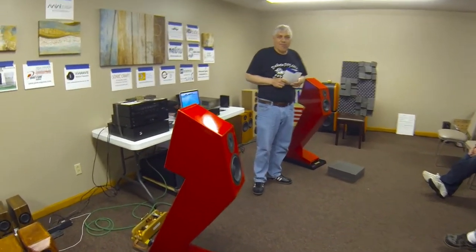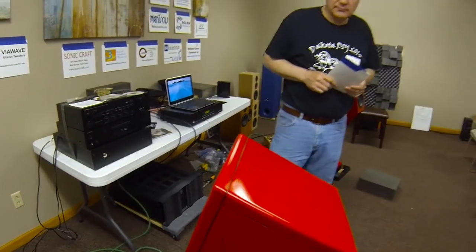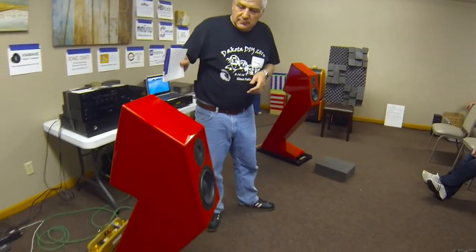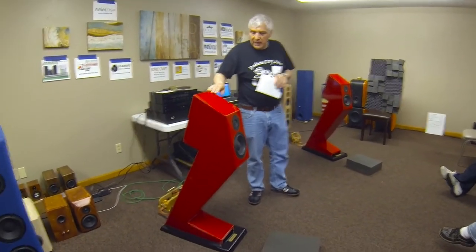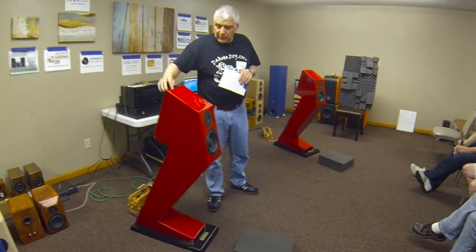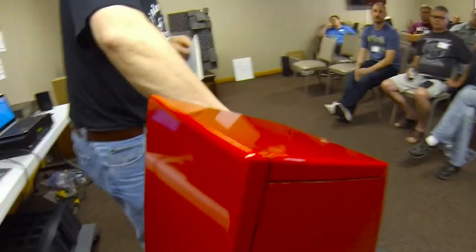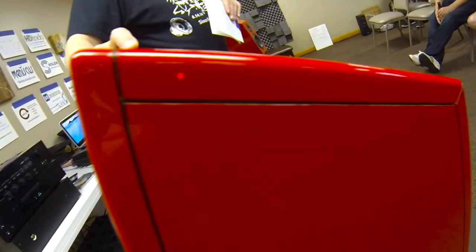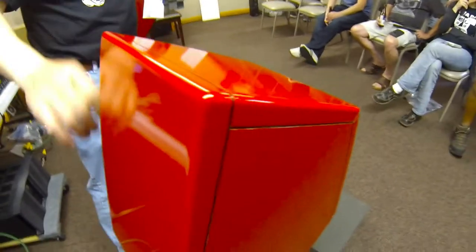The shadow lines — and it's typical of some of your builds — it's three-quarter inch MDF. These shadow lines are where all the butt joint seams are, where all the boards were cut and put together. I took a router with a 1/16th inch straight bit, set up some straight edges, and cut these shadow lines to a depth of 1/16th inch all the way around.